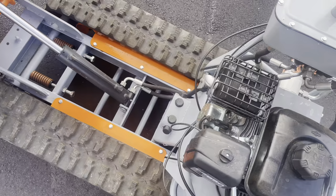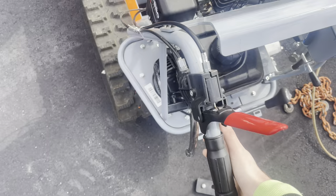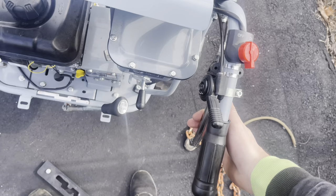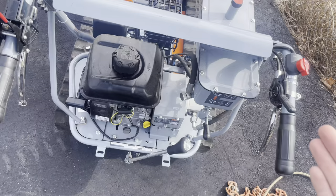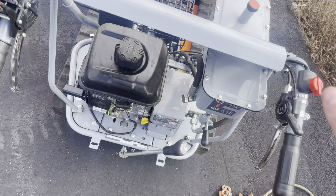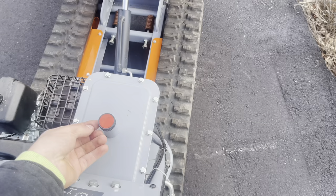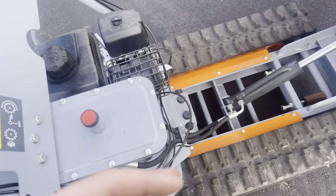There are some small things they could put more money into. The brakes — when you're moving and trying to brake each track it's a little jerky. Those are the only real operational issues I've seen. I also noticed some production line quality issues: when I got it, the motor was tilted and I had to loosen the bolts and straighten it out. Some bolts weren't tightened. They overfilled the hydraulic reservoir, which caused hydraulic oil to leak out of the cap when running, so I had to drain some out.